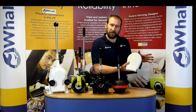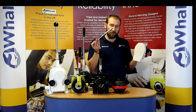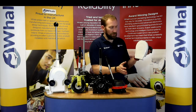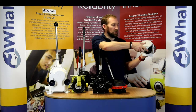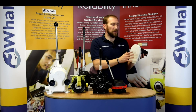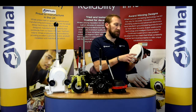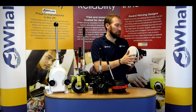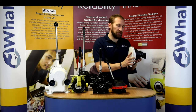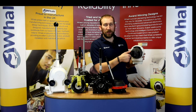The Smart Bail is very different from all the other pumps I've talked about today. We wanted a pump that doesn't have a removable handle, so it's not something that can get lost. The handle is built into the deck cover — lift it up to suck the water in, push it down to pump the water out. The handle is incorporated into the pump itself, so nothing to get lost. It does mean slightly less mechanical advantage, so you might not be pumping it for as long as the others, because they'll pump a lot more water. This pump is very easy to install — you drill one hole in your deck, slide it in, push it down, and put two screws in the bottom, so it's self-locating.